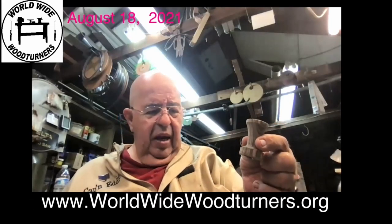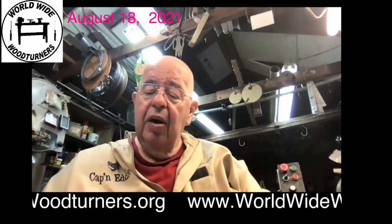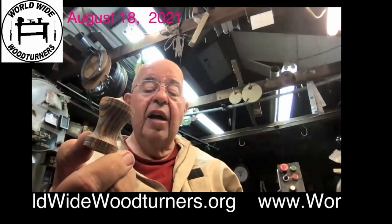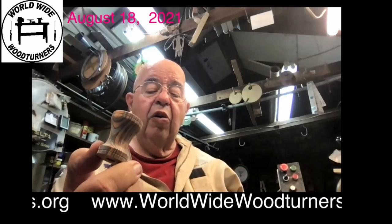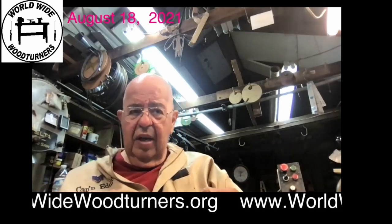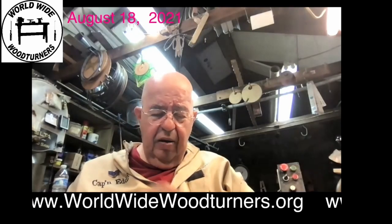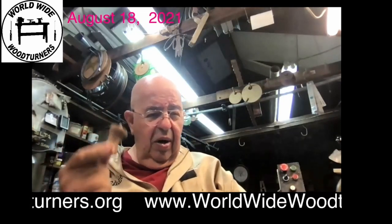That right there. Now, if you take this one I did a couple of days ago, and I burn a few lines in it for accent. See, I've got one grooved out in it now. Burn a few lines in it for accent, seal it with a lacquer sanding sealer, buff it out a little bit, and then get it ready for lacquer. I could have this out in 10 minutes. Now, where's the cost at?